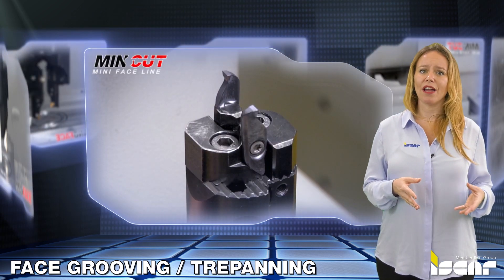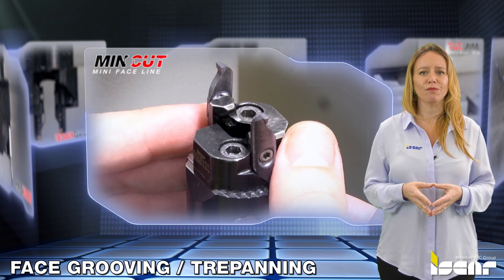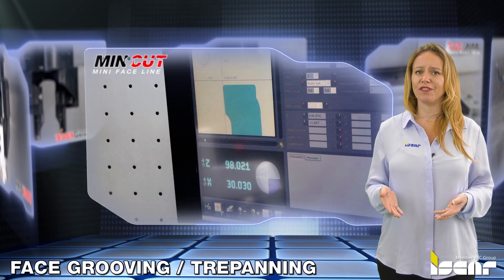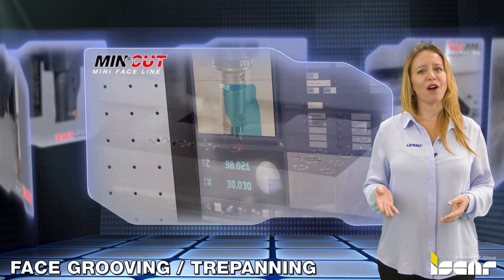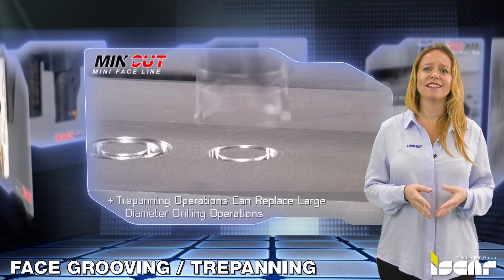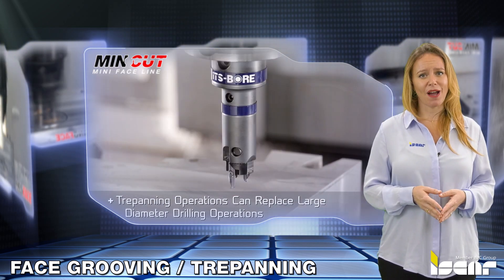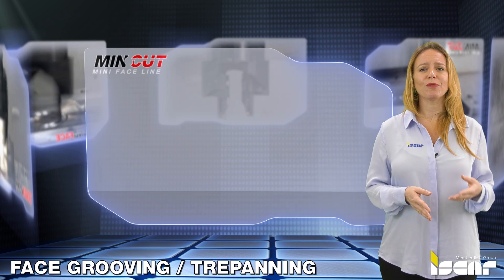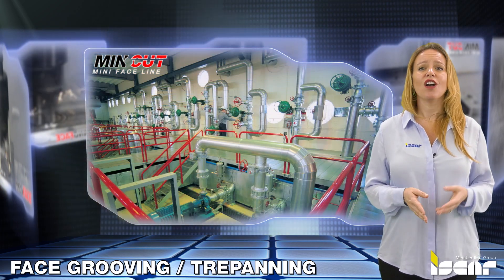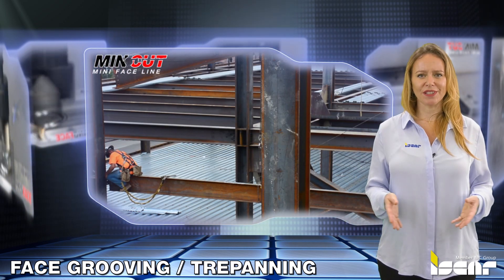The IHSR MIFR cartridges were designed to be mounted on the standard BHR MB-32 rough boring head. They can be used with a single or double cartridge configuration as a half or full effective option. In many cases trepanning operations can replace large diameter drilling operations with significant reduction in machining power. Typical operations can be found in the aerospace industry, oil and gas, hydraulic valves, large size gate valves, construction beams, and general engineering components.